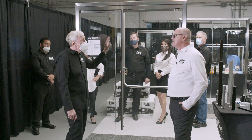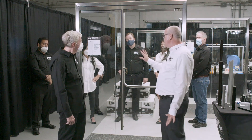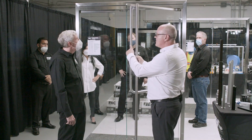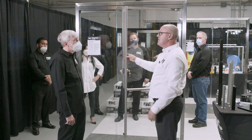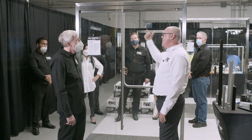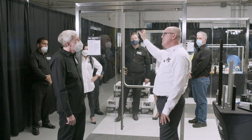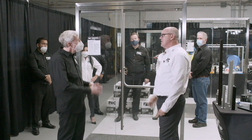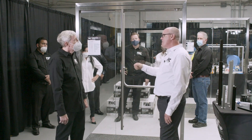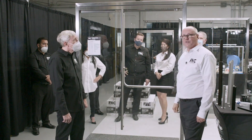And Barry, what type of locking mechanisms and handles can this door support? Well Paul, on this particular door there's an actual panic handle installed along with a manual strike. We can also install electric strike, a ladder handle, or regular commercial pull with mag locks or even a solenoid bolt. We create a build out on the top and the solenoid bolt will also be able to hook into keypads or touchless entry systems. Absolutely — you can wire the electric strike, mag lock, or solenoid bolt into a touchless entry system.